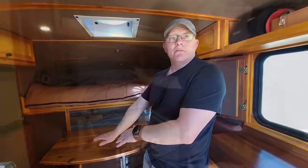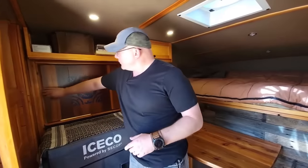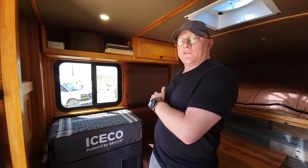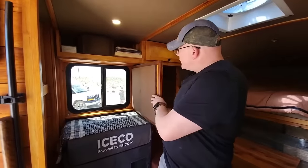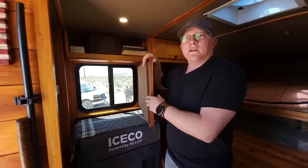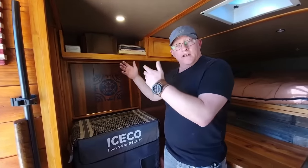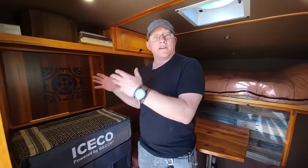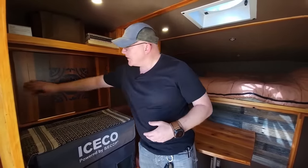third bed down here. These are made out of cedar, and they're hinged, right? And what they do is I can open it, and they nest on this back wall, so they don't affect the livability of the space. But I actually put a 1-inch thick, which is going to be R5, of XPS, or extruded polystyrene, wrapped in fabric, and I can close this, and it provides not only privacy, but it provides excellent insulation capacity for the windows themselves, which is a huge portion of loss.